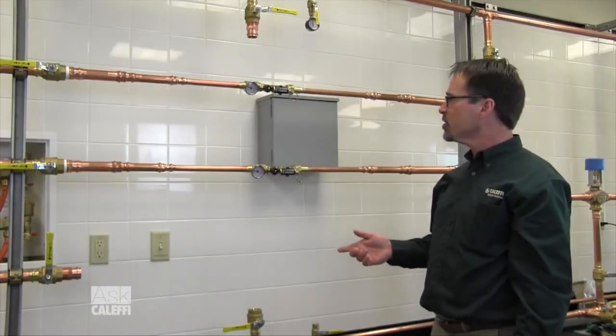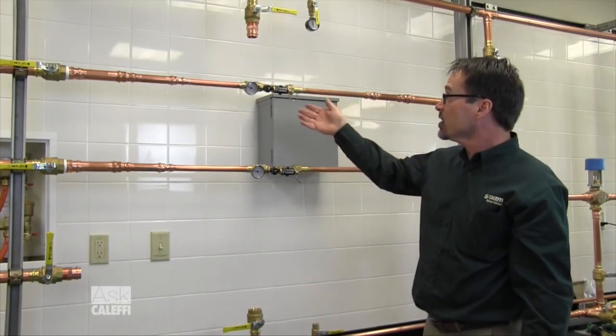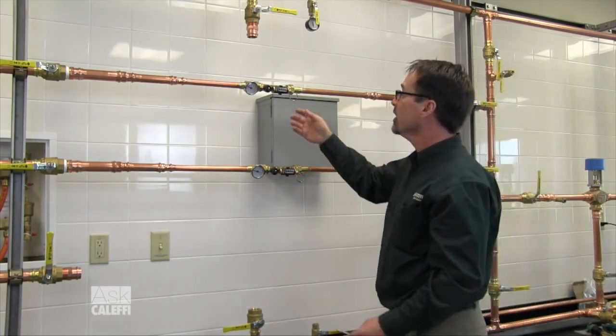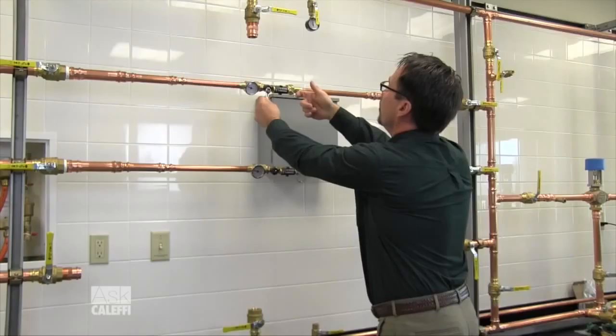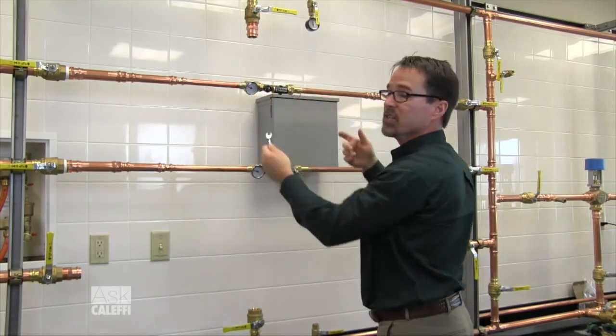This is a simplified demonstration of a couple of domestic hot water recirculation lines. Let's say you need one circuit to be set at 1 GPM and another circuit to be set at 0.5 GPM. All you need to do is get a 3/8-inch wrench, pull the flow pin, and adjust the valve to the point at which the ball is set at the flow you need, and release the pin.